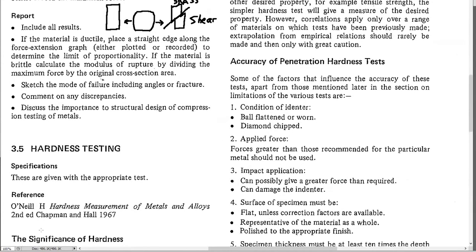The tensile test is by far the most common standard test. The most important outputs are the UTS (ultimate tensile strength), the yield strength — the point where it starts to deform permanently — and stiffness. Those three properties are the most important measurements of a material. From just those three, you know what it takes to break it, deform it, and how much it stretches under load.